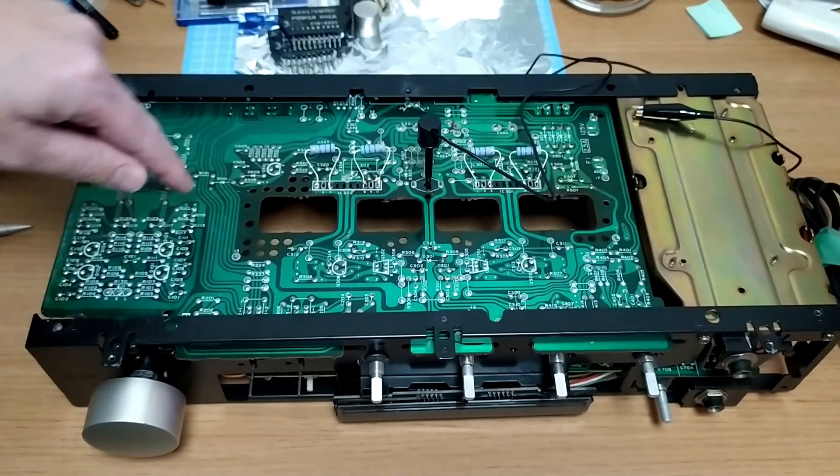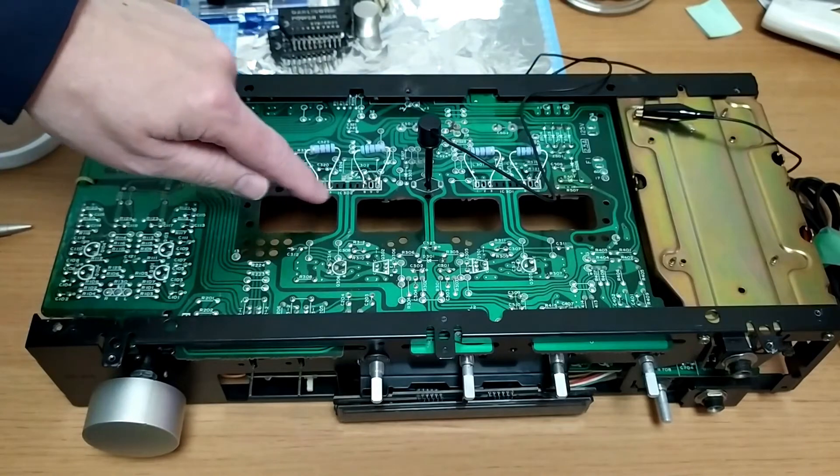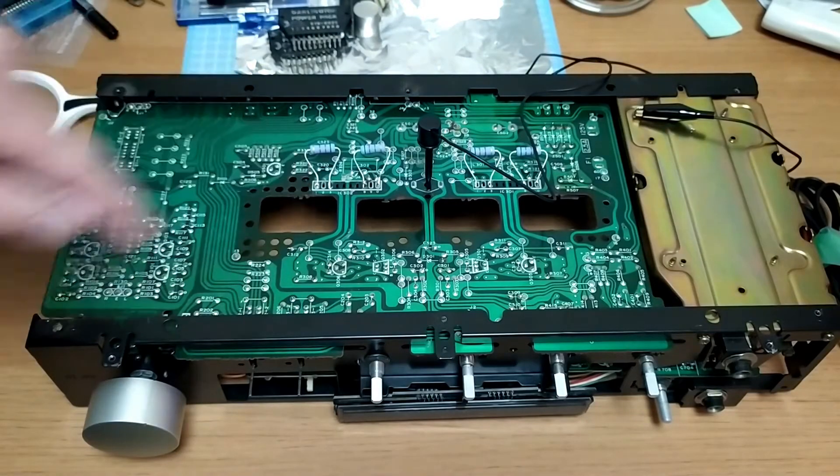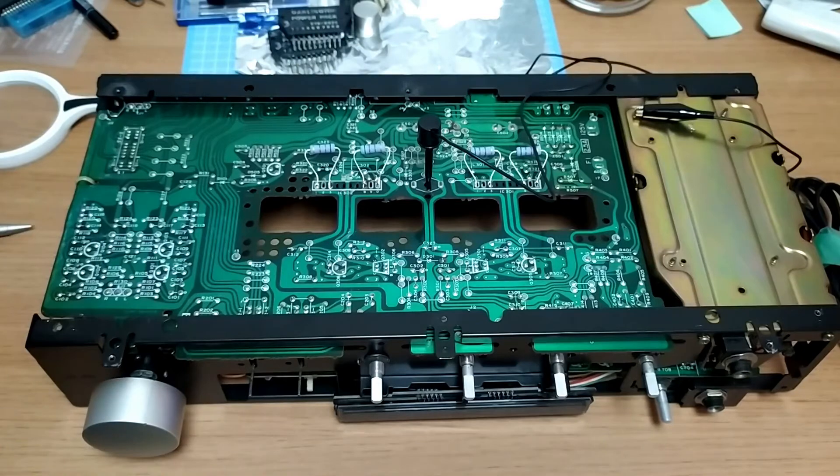What we're getting here now is on pins 1 and 0 we're getting the same absolute value but with opposite signs. I'm getting minus 3.7 on pin 1 and positive 3.7 on the other, and it's pretty much the same values from power pack 1 and power pack 2 — there's about 0.02 of a volt difference. I'm getting 35 volts on the supply lines, and between pins 2 and 9 just the voltage sign changes — same absolute value, opposite sign.